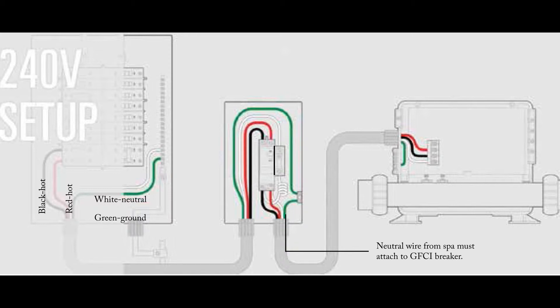However, with a four wire system where we have a neutral also going to the equipment, that's because the equipment is also using 110 volts between one of the hot sides and the neutral. So let's say your 240 volt heater is drawing 20 amps and your 110 volt pump is drawing 5 amps. One of the hot leads is drawing 20 amps for the heater. The other is drawing 25 amps — 20 amps for the heater and 5 amps for the pump. There's also 5 amps in the neutral wire. The GFCI looks at the two hot leads and says there's a 5 amp difference, but then it looks at the neutral and says that's 5 amps also. So as long as they're equal, all's well.